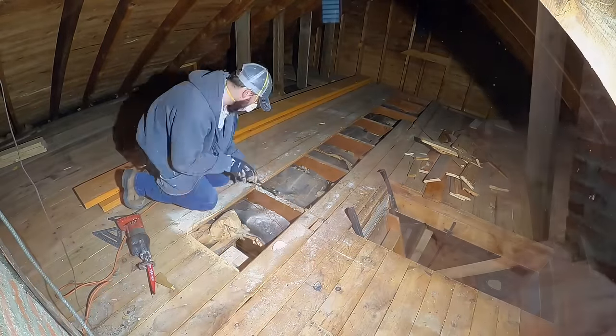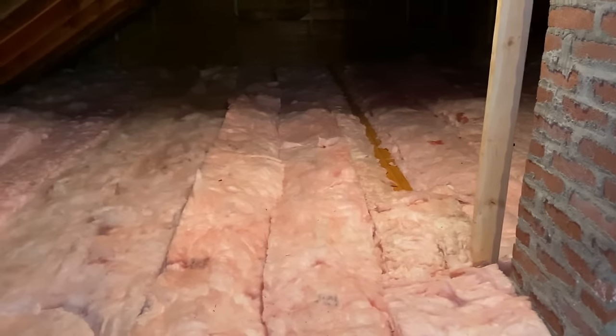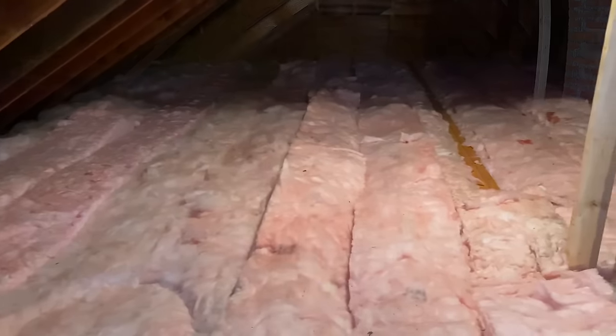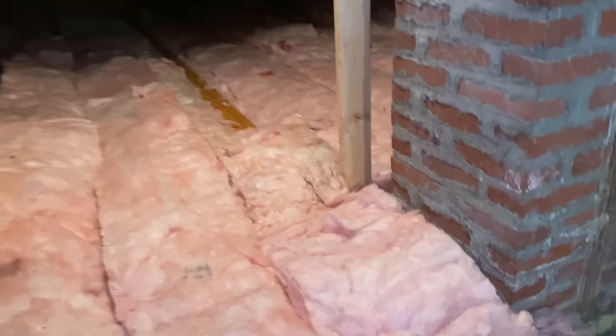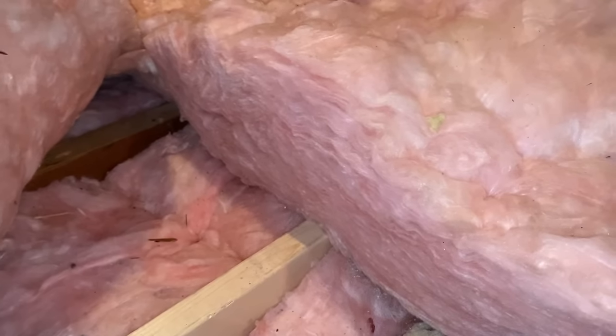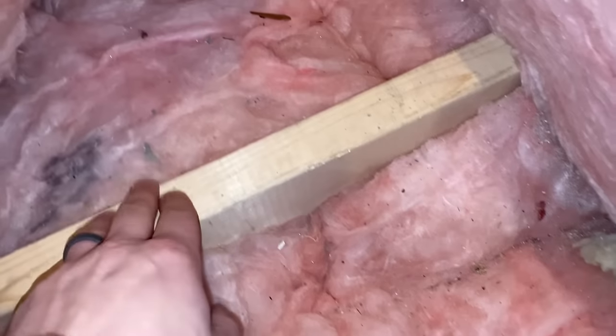And when I remodeled the living room and dining room, I put this beam in, which you can see. And to bring it up to code, I added all this insulation. And the problem with that is the ceiling joists are underneath about 6-7 inches of insulation right here. So typically, like these boards, you would put them right on top here and you'd have a nice storage area. But in order to do that, I'm gonna have to do a little more than just add plywood.